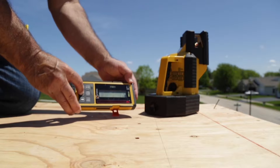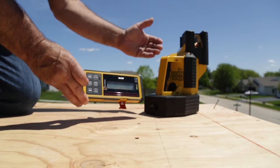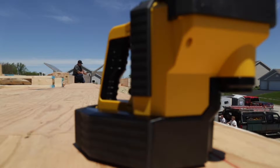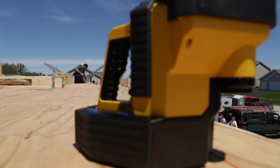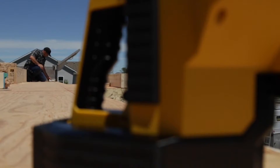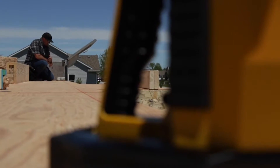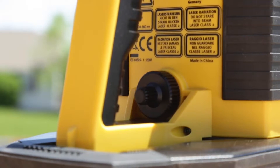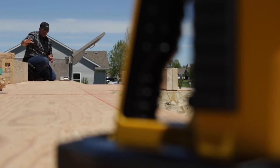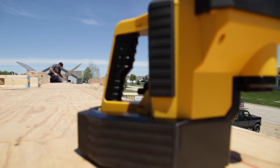How you arm the receiver — I'm going to take that kickstand, snap it directly out, and then what I'm going to do is hold down these crosshair buttons. What that allows the laser to do is talk to the receiver. As I hold it down, you'll see two lights light up and you see the crosshairs. Right now the receiver's talking to the laser, making it auto-align. Now I'm going to go ahead and place the receiver on the second control line and arm the receiver. Now the receiver's talking to the laser — the laser's going to auto-align, locking on our control line, establishing this first long run. As the laser sweeps, it's looking to lock on to the receiver. It takes roughly 10 to 15 seconds, but with job site conditions, it doesn't always allow you to pull that 3-4-5 or 30-40-50. Now the layout station's locked onto the receiver and we can pick up our 90-degree layout.